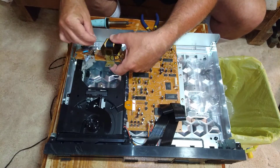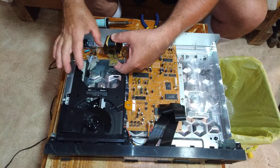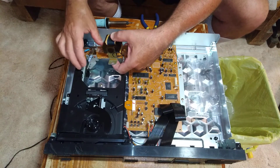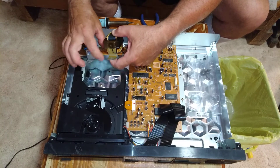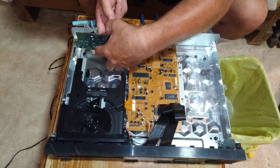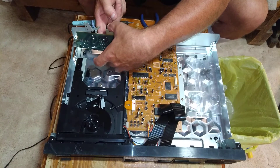That's going to fit in really nice. I'm going to put this in on this side, get it centered, and now while I'm holding it on the back side, I'll bend this lead over and bend that lead over so it stays flush to the board.